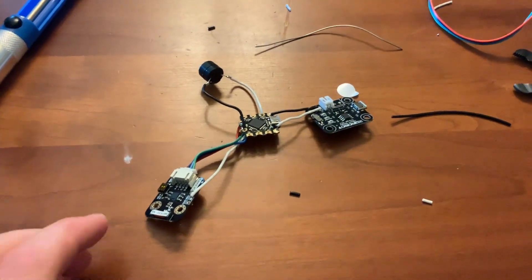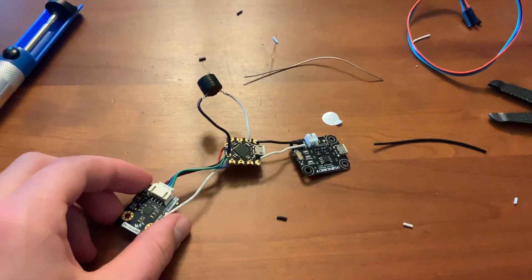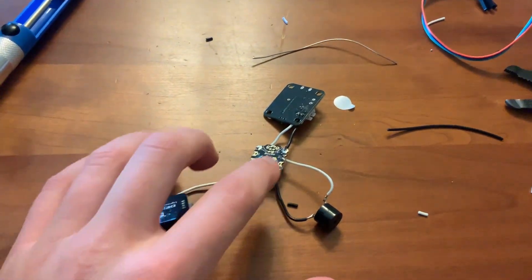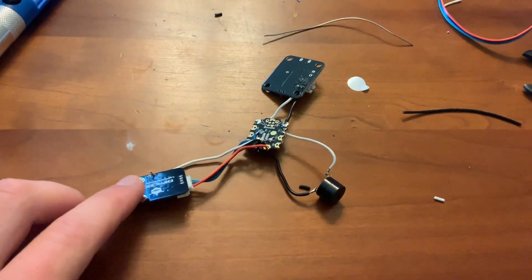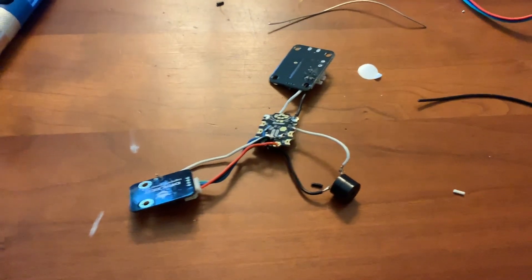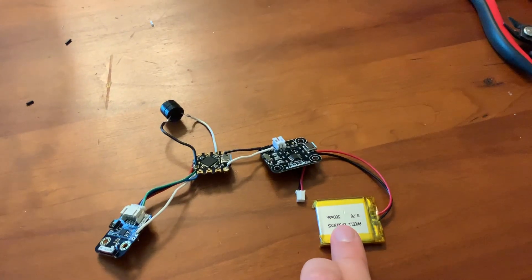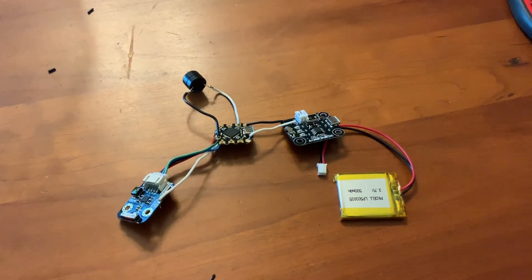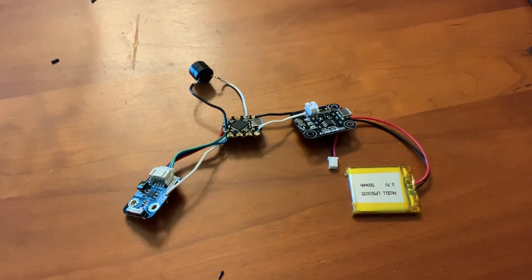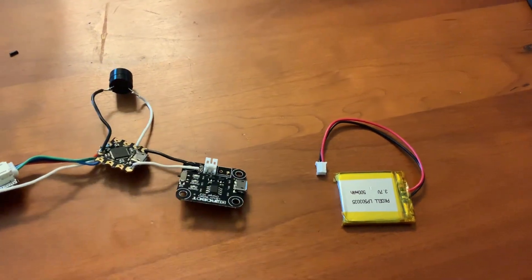Here's the finished circuit. As you can tell, it's not very big and it's not very pretty, but I'm going to make it smaller by folding everything in on itself and cleaning up the wires as I do so. I need to cut off the excess wire leads, as they'll likely cause shorts. I might apply some hot glue on the back to cover up the pads. I'm also going to plug in the battery, which will serve as the base to build everything off of since it's the biggest component. I'll stack and secure everything with hot glue as I go. There's a tiny switch on the battery charger that I want to use as the on/off switch, and I also need to keep the micro USB port on the microcontroller accessible for programming.